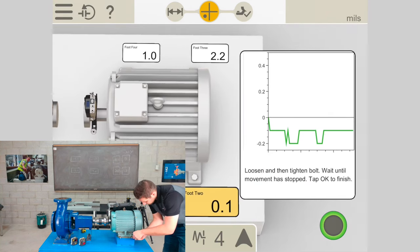I'll start at the 9 o'clock position — the inclinometer confirms 90 degrees — and press the green button to take a measurement. Then I come up to 12 o'clock and take my second measurement. Finally I come down to 3 o'clock, which shows negative 90 degrees, and take the third. I now have my alignment results in a table showing two measurements for the vertical plane — offset and angular — and two for the horizontal plane — offset and angular.